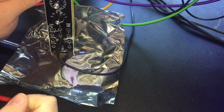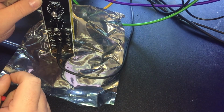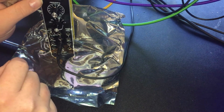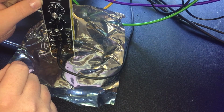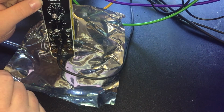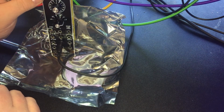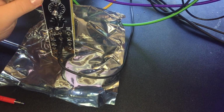Normally what you'd have to do is keep on going back and forth, adjusting your trimmer, taking out the negative 2 volts, until you got it to that point where you plug it in and you get 160, you plug it out, you get 640 without having to adjust anything, and at that point it's accurate to 1 volt per octave. But like I say, I didn't need to do anything. It's absolutely fine. So I hope the replacement 921's like that as well.